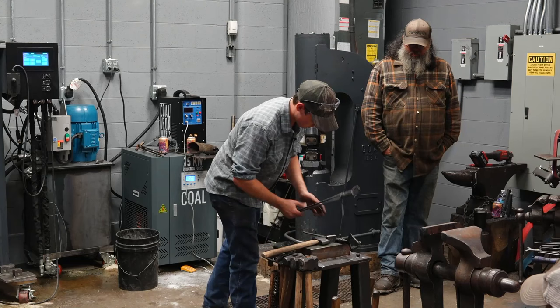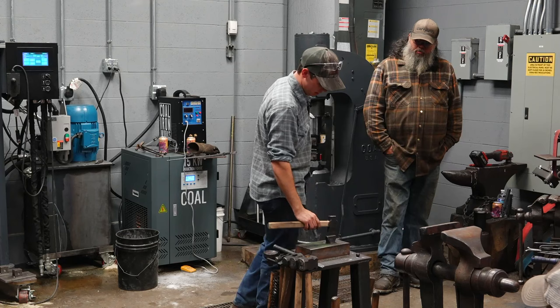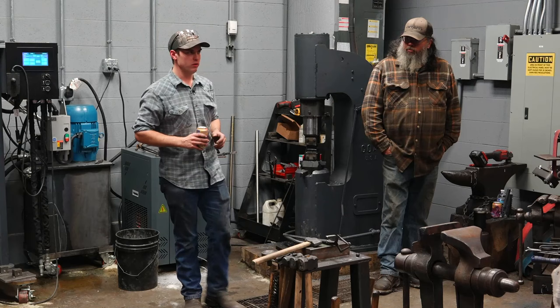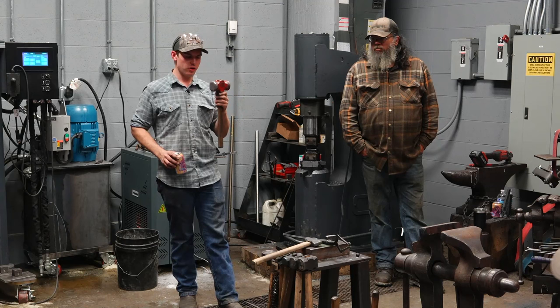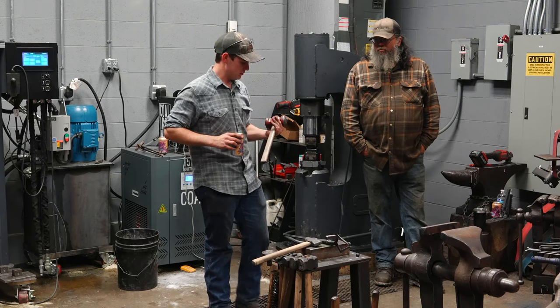So the next heat, we're going to use a top and bottom fuller. You've seen me use the top fuller. We're going to use a bottom fuller now as well. One thing that is important with this, since we have trough lines on both sides of the hammer and you're using a sequence, is that the striker strikes just as hard or just as soft on both sides. You want them to strike evenly. Otherwise, they'll come out different even though you're using a sequence. So that's somewhat important.